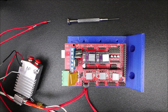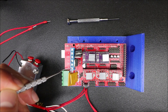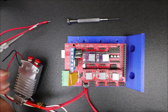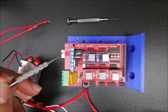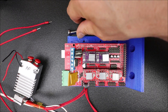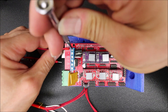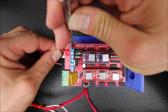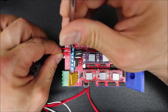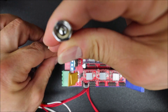To install the dual port extruder or cyclops, we need to know our connections. We have D10, D9, and D8. We're going to use the ramps configuration of extruder, fan, bed — so extruder, fan, and then bed — but we're going to leave off the bed portion. We're going to take the heater cartridge wires and connect them to our port right here. Plus and minus doesn't matter for this because it's not required for the heating cartridge.